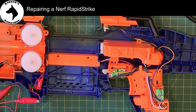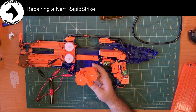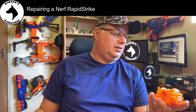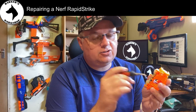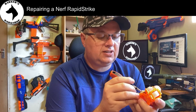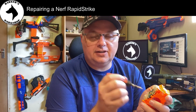Then I discovered the issue. These are the original motors that were in this gun, and at the back I found there was a broken connection — it kind of broke off flush with the PCB. I can't see a soldering point and I can see the green surface area of the board actually started to lift up, so I think this board is gone.